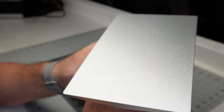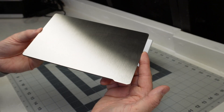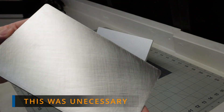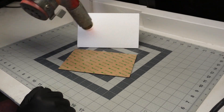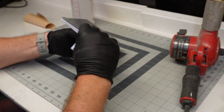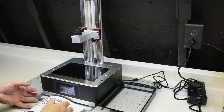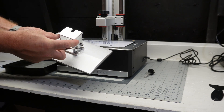This is the build plate with a nice laser-etched surface on it. I didn't use it as-is — I went immediately and put a flex plate on because I want to print some pretty small things and don't want to fight to take them off the plate without breaking them. I sanded it because I didn't feel like the surface had enough etch, but that was completely unnecessary — I actually ended up smoothing it out a little. Here I'm heating up the flex plate and the build plate with a heat gun, warming it up and sticking it on. The screen protector is really good — I got a drop of resin on the bottom of my tank and it cured to the protector, but I was able to just peel it right off with some alcohol. I highly recommend one.